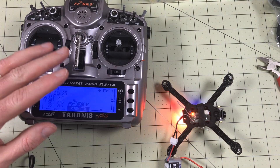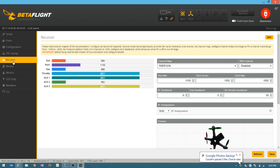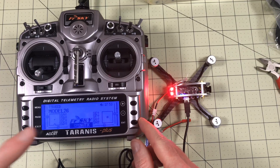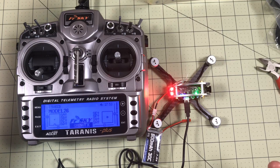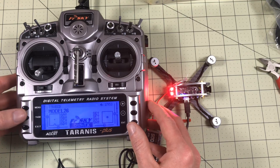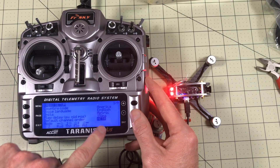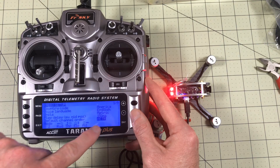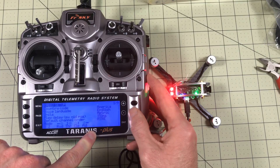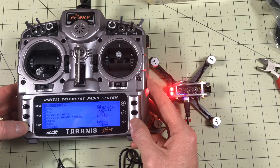I'm going to reboot everything just to be safe. I'm in Betaflight, I'm connected. Let's go to Receiver and see if it shows anything. The channels are totally messed up, so I'm going to have to fix that. I had to redo it and redo the model — I did have to set it up as AETR. I don't exactly know why, but it did work. I learned that you can hold down the menu and set the default channel order to AETR, which just affects it while you're setting up a new model. So you can set this and then change it back to TAER so your next models are all right.